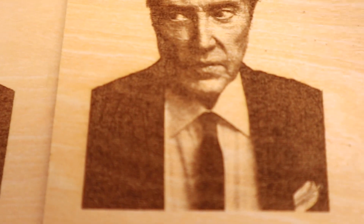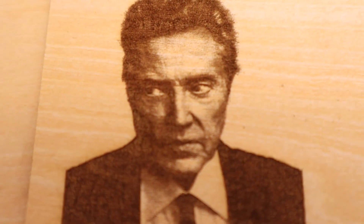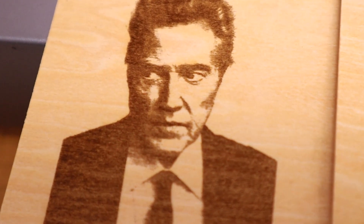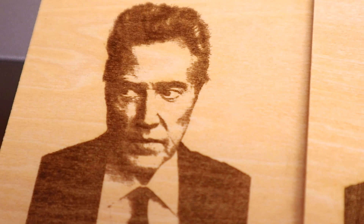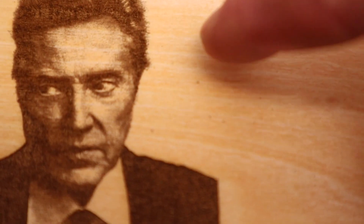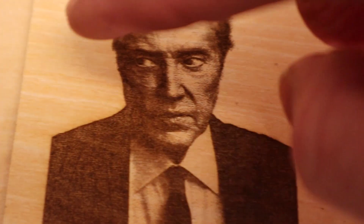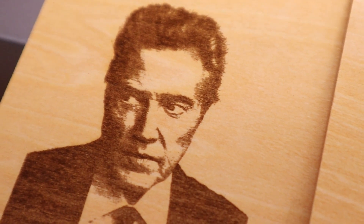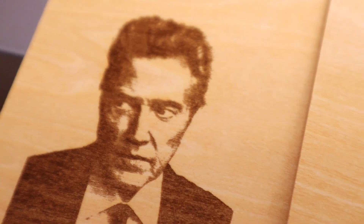Here's the result of the first test. This one without the air assist — the engraving actually looks pretty good. And there is with the air assist. Strangely enough, and I have to be honest, the one without the air assist looks better. I think that's because of the micro detail of the engraving, where some of the smoke or small detail was more embedded in the wood, whereas with air assist it might have been blown away off the surface. With a deeper engrave, maybe a little bit slower, we'd probably see a difference.